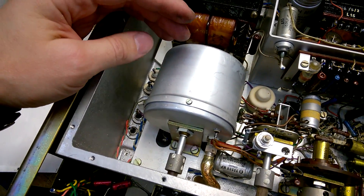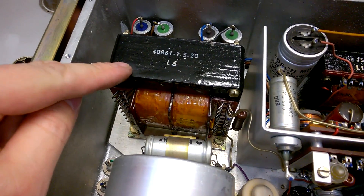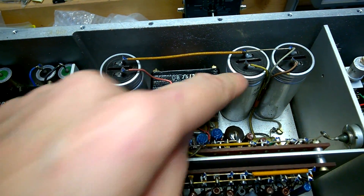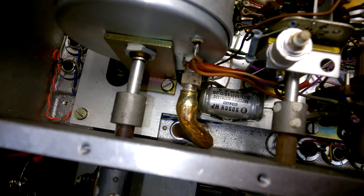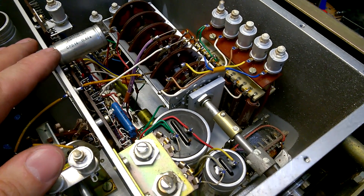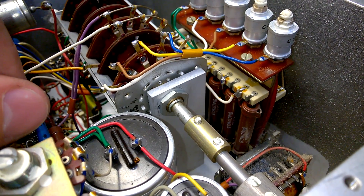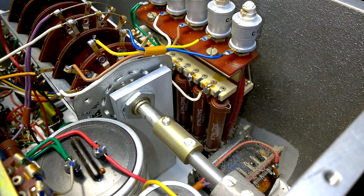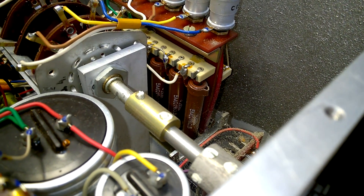Here I guess is a large capacitor — no, it's a switch. We see a large DC coil for the anode voltage, another DC coil — a classical CLC network. And much more interesting, beautiful components. So here is where the frequency generation happens, the frequency selection happens. We see some precision resistors and they are for timing purposes.